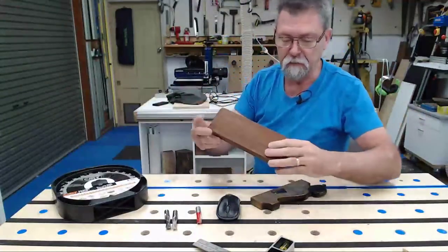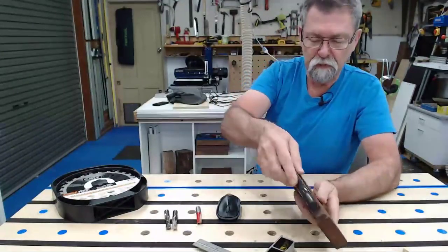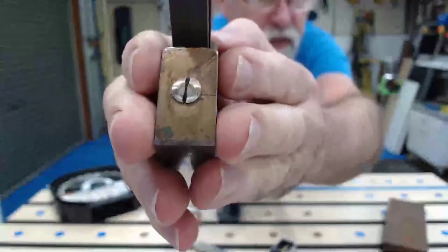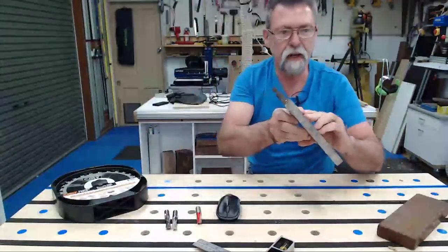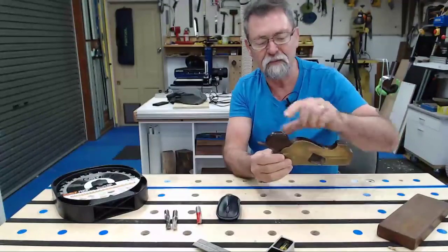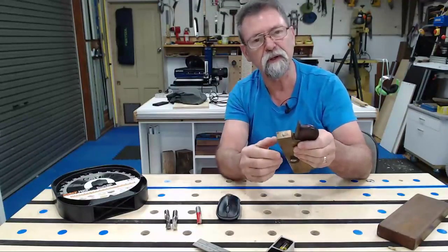Anyway, Arthur had made these Australian cedar boxes, and they've got felt in the bottom of them. And when you put them in, they lock in on purpose. Oh, here's something I didn't realize when I did the videos about all this. On the back here, and I'm going to bring it in nice and close, see that? That screw head is there for a reason. When you change the blade on these guys, use a hammer and you hit the back. You hit it and it releases the wedge and the blade. And you don't want the back to be flared out on the brass section because that would interrupt the plane if you're in a very deep dado, wouldn't it?